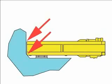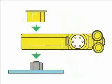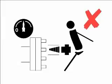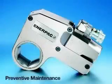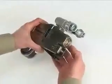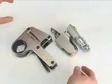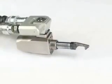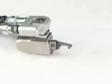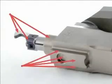Make sure there is sufficient clearance for the W-Wrench so it is allowed to move without binding up on any nearby surfaces. Damage to the W-Wrench, the nut or bolt, and injury to the user may result if there is not proper clearance for the wrench. Make sure the correct size cassette is used on the nut. Reducers are available for common sizes. Do not work in line with the bolt if you are tightening or loosening. Preventive maintenance — drive unit: check the tightness of the swivel manifold pin screws. Remove the drive unit from the cassette and dry all components. A mild solvent can be used to clean the W drive unit and cassette. Pressurize the drive unit to maximum pressure. Advance and retract and check for leaks. Damaged components or seals must be replaced. Apply a thin coat of molybdenum disulfide to the locations as shown.